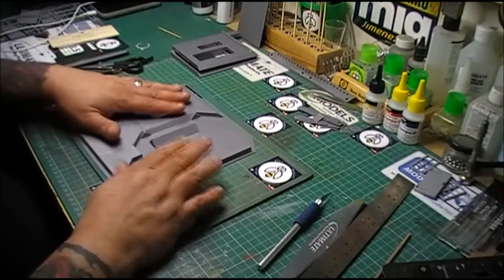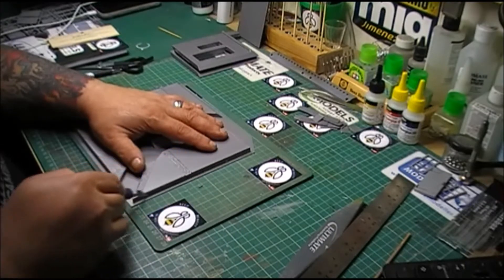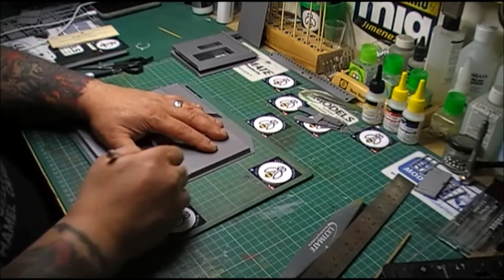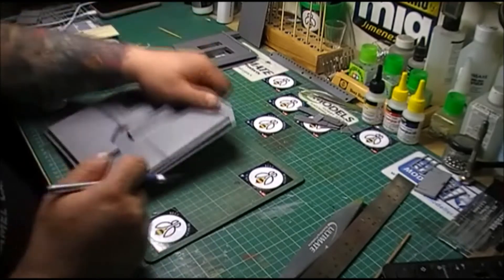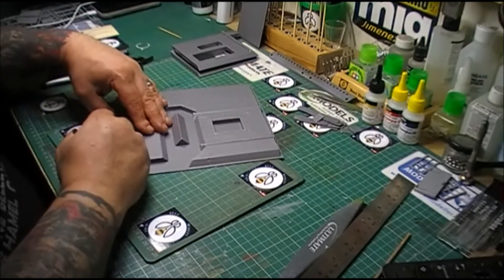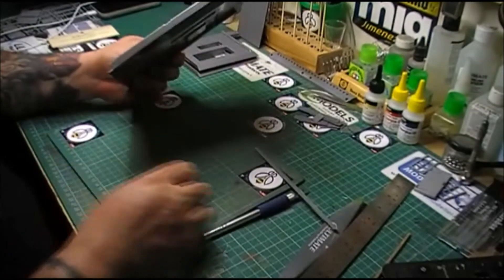I'll give you a quick example. So basically you get your VAC formed piece, take your knife - I use the back end of the knife, the straight end, not the sharp end. Basically all you do is you just score it a few times. If you carefully use your sharp end as well, once you've scored it a few times, you can use your blade. But you have to watch, because sometimes it can suddenly run off track. And there it is - that's how easy it is to come off.